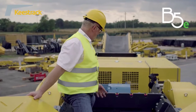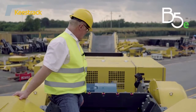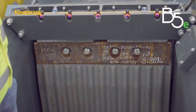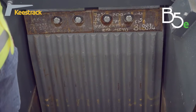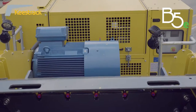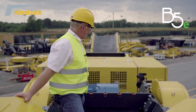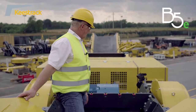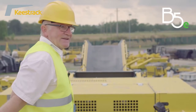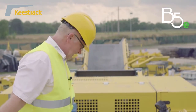So the heart of the machine for sure is the jaw crusher. The heavy duty jaw crusher, what we see here, is nearly 20 tons. It has a width of 1100 millimeter and a depth of 700 millimeter. It is driven by an electric motor 132 kilowatt via V-belts and extremely heavy duty discs for driving the crusher. The driving disc has grooves to bring over the full power of the electric motor to the crusher.